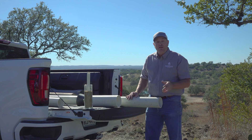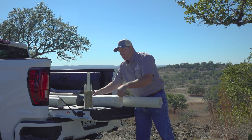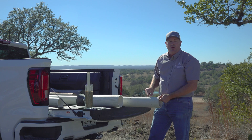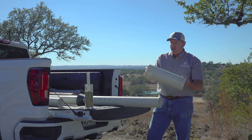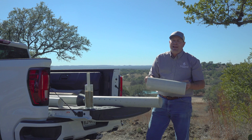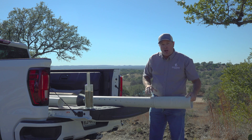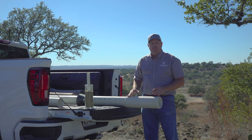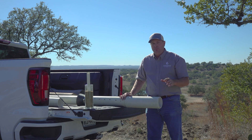The last option we have for you is manufactured screen. It's just regular pipe that the manufacturer cuts really, really fine slots in. Remember that gravel pack with the really fine gravel — if you're going to stop that from coming in, you're not going to do that with little quarter-inch holes, so the way that we do that is with manufactured screen. The problem is that this stuff is very brittle. Imagine trying to get 60 feet of this down in a well 800 feet deep — it isn't likely to survive. So what we do is take our regular casing, drill small holes in it, and then take this slightly larger manufactured screen and slide it over our perforated casing. This creates a double pipe system that has the strength of regular pipe but the filtering ability of the manufactured screen. The cost difference is minimal, but the results are amazing.